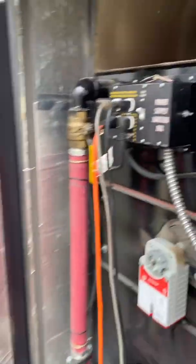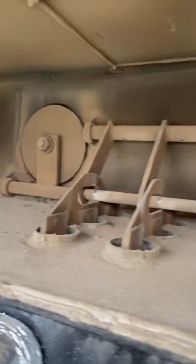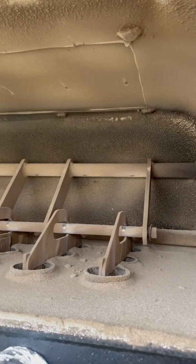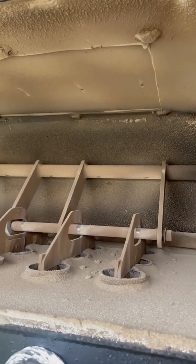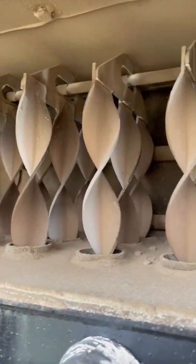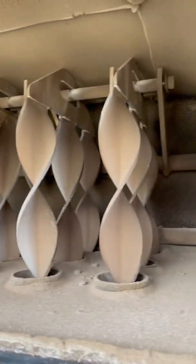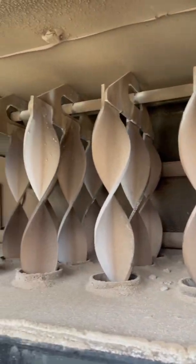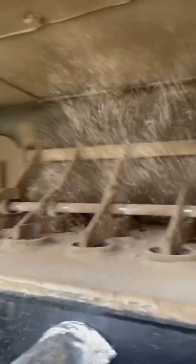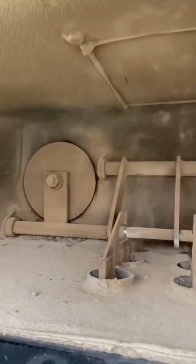You can also check the back — pull the panel. You should never find anything back here that looks like creosote. If you do, it's because the unit is not gassing all the time, or at all. If you let it go, you're going to have issues. You can see there's nothing but fly ash here. If you've got any tar starting to build up, you need to double-check your moisture content, split size, and so on.